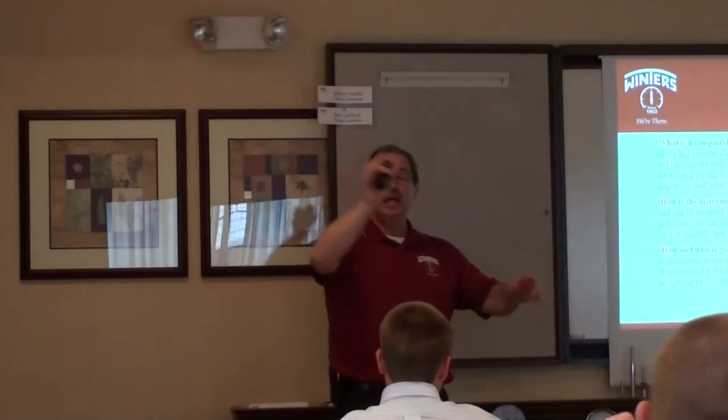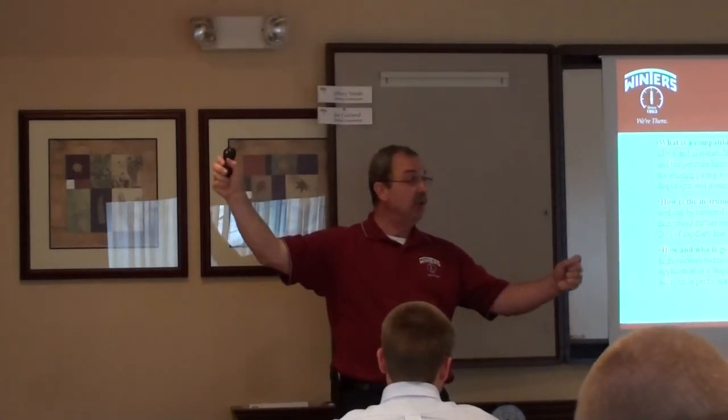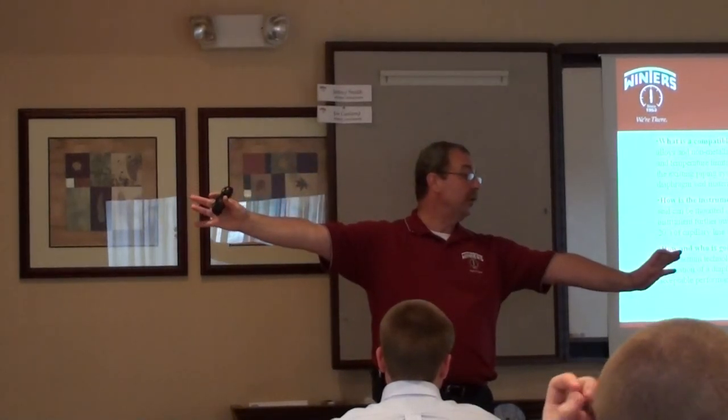What happens is they pull a vacuum through the capillary, and when it gets solidly filled with no air, it operates like a push rod. So there is no air. It's not a problem that it's 20, 30 feet long.